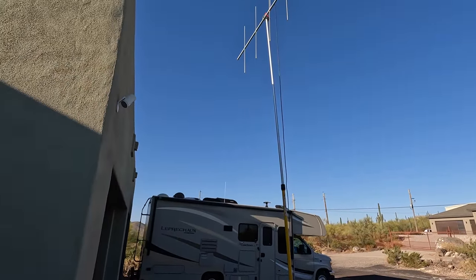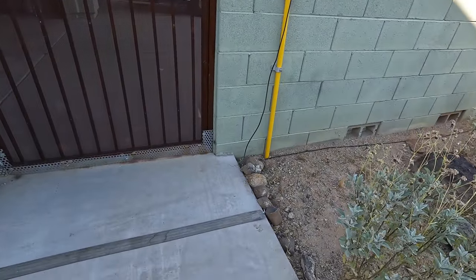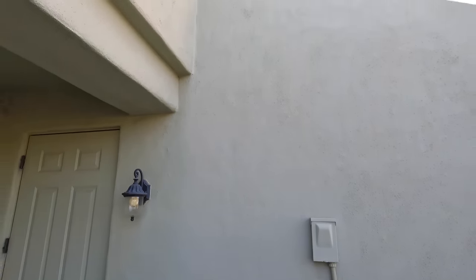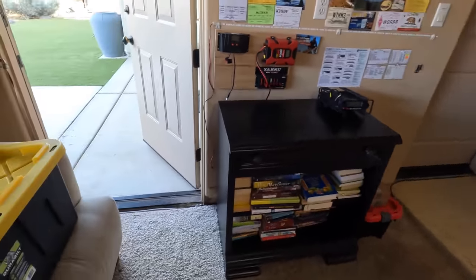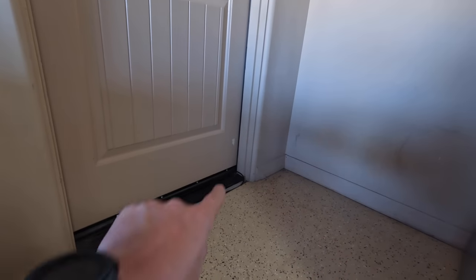For the last year or so I've been running the Yagi over here. To get across the threshold I've been using a wire threshold that has both coax lines running alongside, and then a dryer duct that goes into the garage. Not perfect. In the future I'm probably going to do a proper run up this side of the building and put a proper VHF vertical antenna, at which point we'll go with LMR 400 for lower loss.